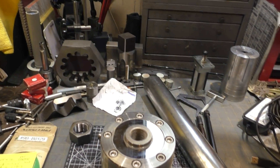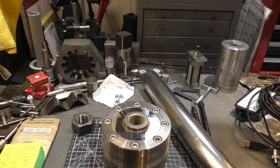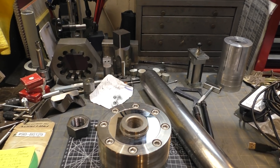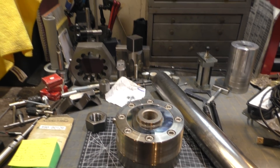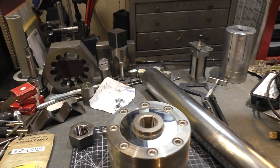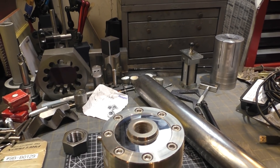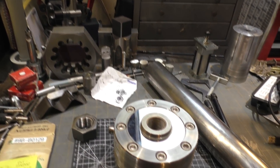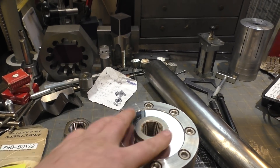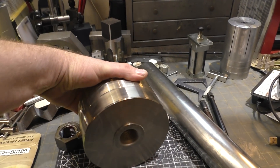What I did was I acquired a 100,000 pound load cell. With this load cell we can push it between the RAM and the press plates and measure the force. But first I've got to take this 4140 stock over here and make some press plates out of it, threaded with one and a quarter 12 threads, one for each side, so I have something to press against without damaging the ground surfaces — the top and bottom pressing portions.